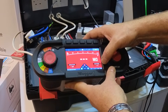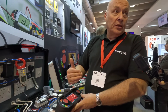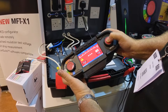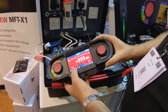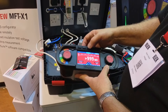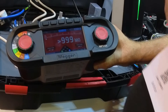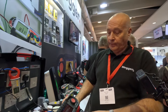We've also got the actual voltage used displayed, where the regulations call for plus 25% minus nothing. This unit is plus 2%, so we're only putting into a 500-volt circuit about five extra volts. We do the test as normal — press and hold down, wait till you get a value. Take your finger off the button; discharge is 505 volts. You've also got the leakage current used in that test. There's also a button at the top for transferring data directly into our Certsuite software package via Bluetooth — when the indicator goes solid, you've got the connection.